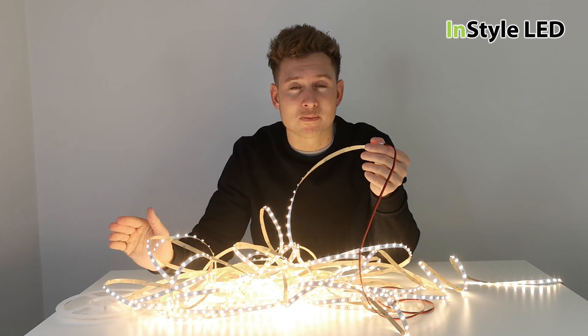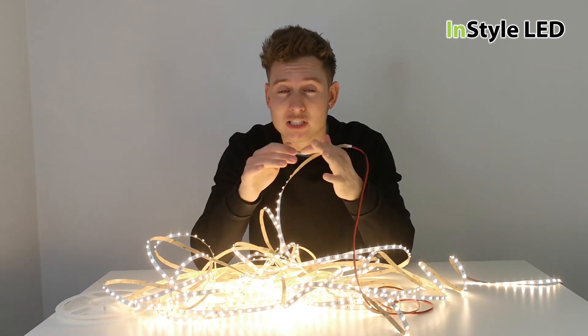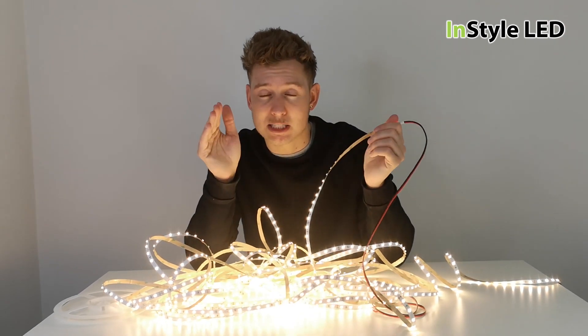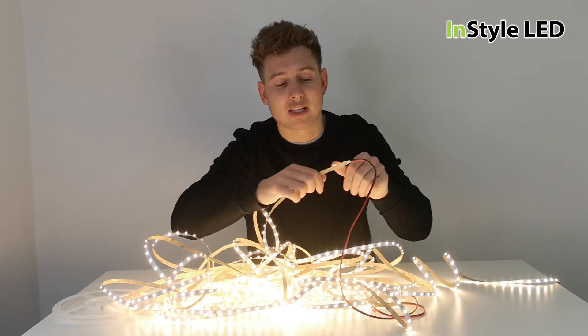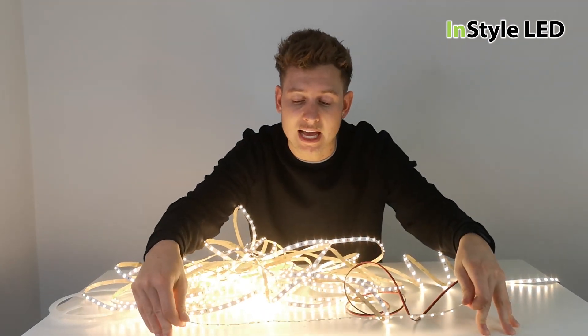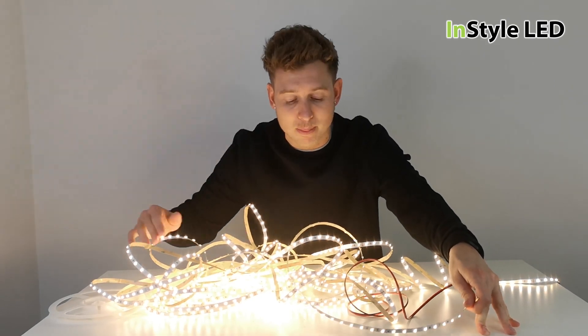Too noticeable for the LED strips to be classed as fully working. So usually if you had a 10 meter LED strip powered from one end, after around six meters the light loss between the six and the 10 meters will be duller and duller. You hold the lights up against the wall or your area and they will just look as if they are disappearing, or not on at all.